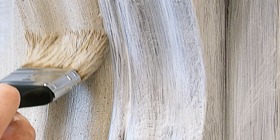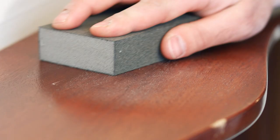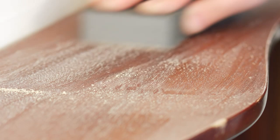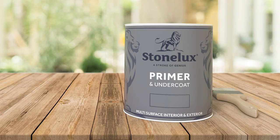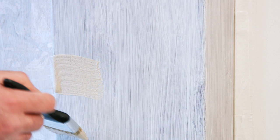Application is quick and easy — all you need is a paintbrush and sandpaper. Make sure you sand pre-painted and glossy surfaces such as marble to provide a key. Next, ensure the area is clean, dry, and free from dust. For even better coverage, use a Stone Lux primer.